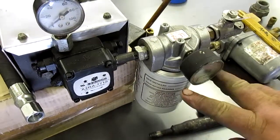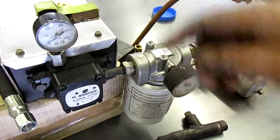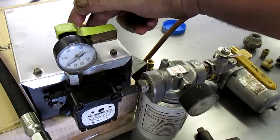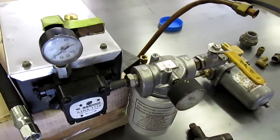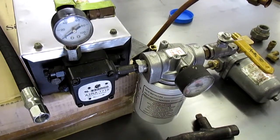This is typically a suction leak on the suction side of the oil pump, or possibly sucking air around the shaft seal in the back of the pump. To check this, follow the instructions in our meter pump book that came with the furnace.